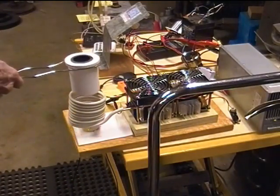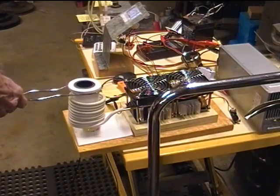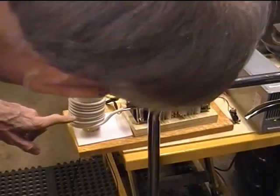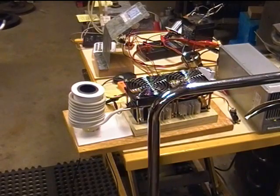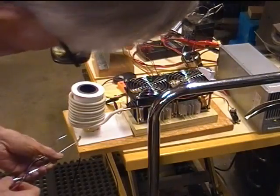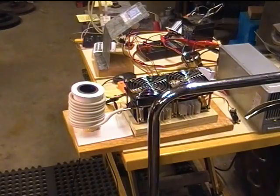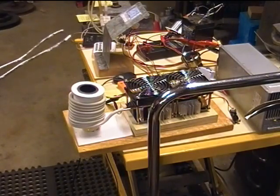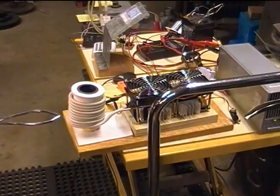4 amps, putting the crucible in. 10, 18, 20, 25, 30, 32. And I've got the crucible jacked up just a little bit, so there's probably 3/8 of it that isn't all the way down in the bottom. So right now it's drawing 32 amps. From a test I did yesterday, if I take one of my little support pieces of ceramic out of here, the current would go up to maybe 36 amps. Water temperature staying at 17.9. That's really great. 12 minutes and 48 seconds into the test.